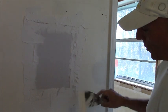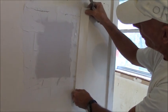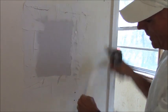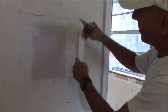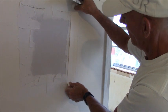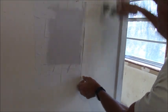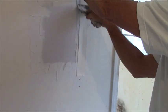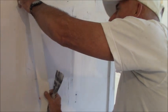And so you just follow where your crease is at, and then you do your length. You overshoot a little bit and then just rip it off. And remember your crease is going to embed inside of this crack. So you get a little excess off from the top right there for now. Then push down really hard because that gets the excess mud off that you put on there. And then the same thing for the left and top and bottom.